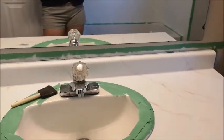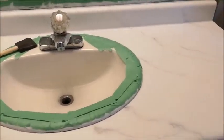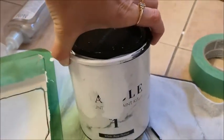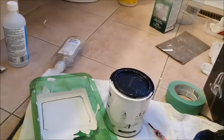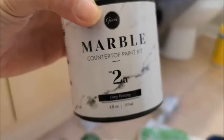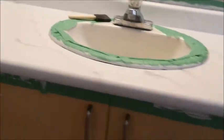I forget where I left off talking about the method for the countertops — I think I showed the kit in the beginning of the video. The first coat can is number one. I ended up doing about three coats, waiting four hours between each. After that was done, I moved on to can 2A, which is the gray veining. It's just a small can but there's plenty — I hardly used much at all, especially since I'm doing a bathroom, not a kitchen, so I have a much smaller area.